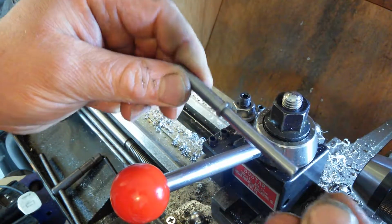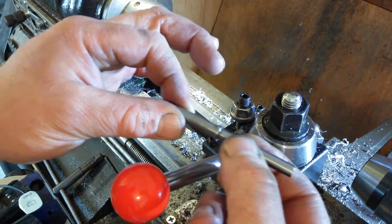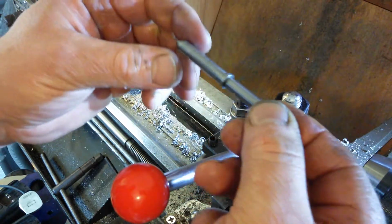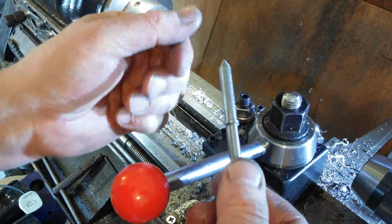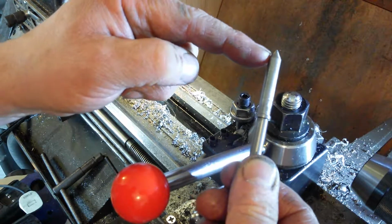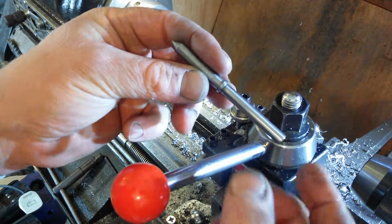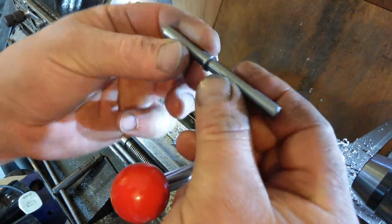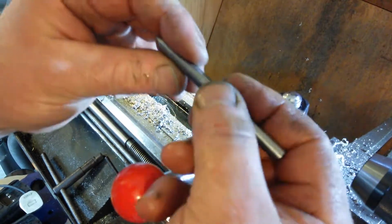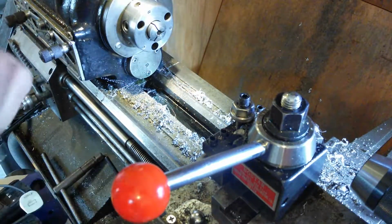And then I might do it at the rear end then as well. I might just do the whole thing. I might just hold it on this land here with a pair of pliers. And do that final bit of corrosion prevention. Yeah, we'll try that with a bit of butane in a bit. Heat that tip up until it's glowing red hot, just that very end bit there. Quench that so it's rock hard. Temper it a little bit. And then heat treat the whole thing with oil. And give it some corrosion protection. Sounds good. Although I might forget to do the old corrosion protection after I've heat treated the front end. You never know. The surface on that now is wicked. About 320 down it. Awesome.